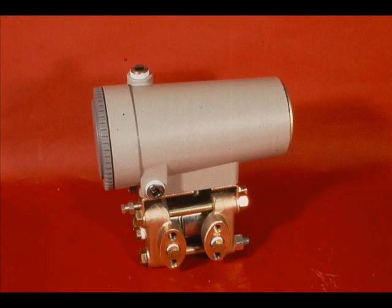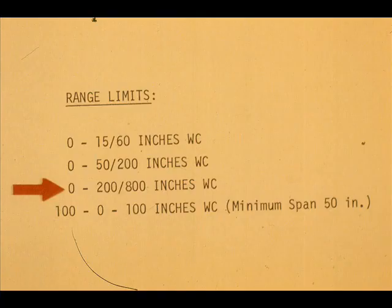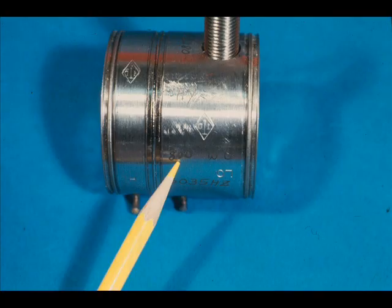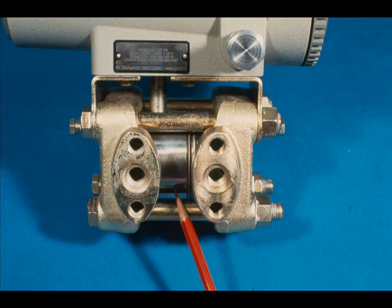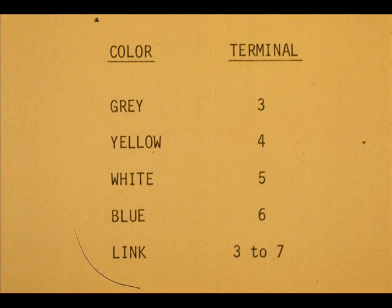Next, we will change the range of our same 56DP transmitter to 0 to 300 inches. This cell body is stamped for a maximum span of 200 inches, so we will have to replace it. The 0 to 200/800 cell body is suitable for a 0 to 300 inch range — this is the proper cell body, stamped 800 inches. Be sure to tag, make a note, or have access to the instruction book for proper replacement of the wires.